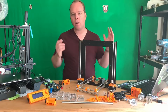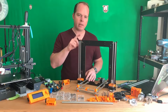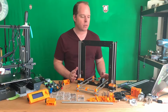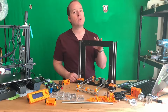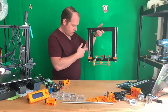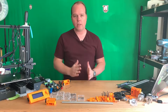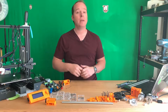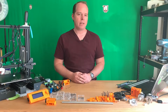As I mentioned, I was doing a dry fitting and I pre-drilled some holes, but on this side it's not the right height as this one. For the building itself, it doesn't really matter. In the future I will exchange the Z frame for a metal version. So let's put this on the side. As you can see, it's pretty steady. I also did a re-measurement to make sure that on one side it's 100 and on the other side of the frame is 185. So now let's continue with the X gantry.